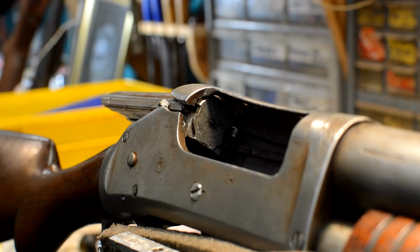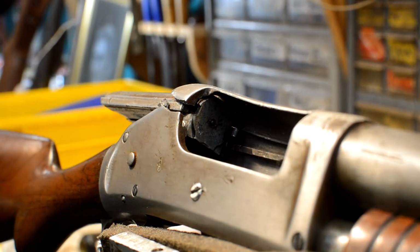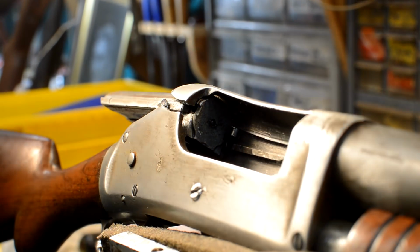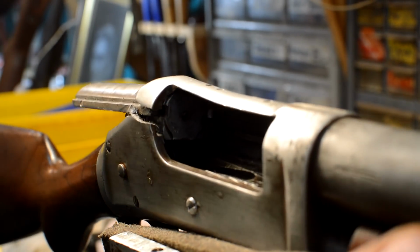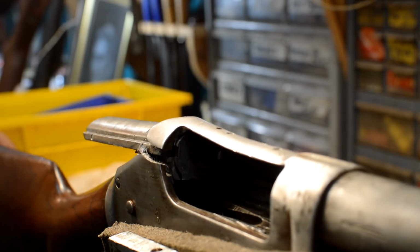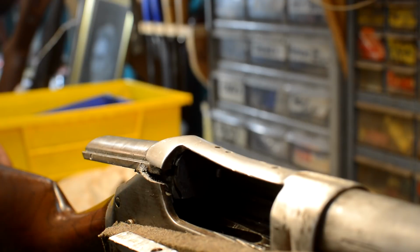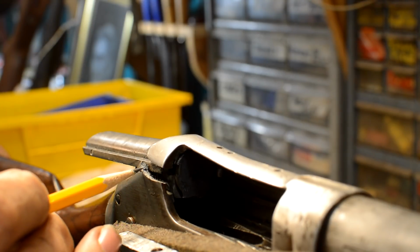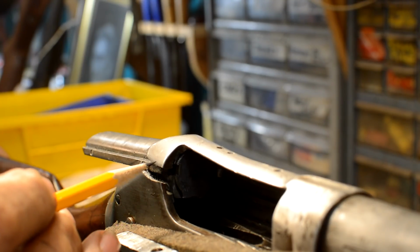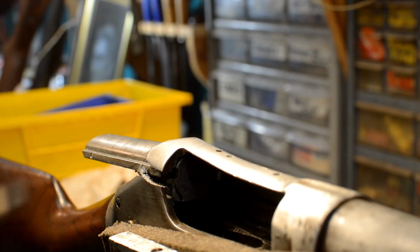We got sent this thing a while back to use as an adjunct to "Why Did My Gun Explode." This is an 1897 that has suffered catastrophic receiver damage because the bolt was expelled in an out-of-battery fire, as best as I can tell. Now, I have not dynamited this thing apart yet, but you can see that the metal definitely brittle fractured. You can see how it's shiny. This thing was pulled to a point where it exceeded its yield stress and it popped.